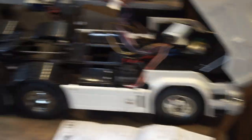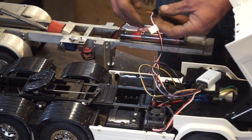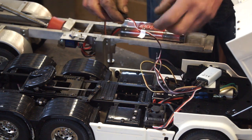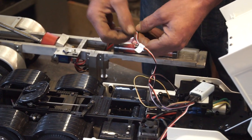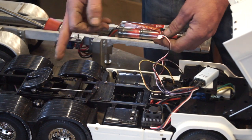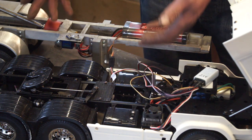The only difference is when you're using two speed controllers — whether on a rigid or articulated vehicle — you get a conflict between the speed controller for your mechanism and the one on your wagon. What you need to do is cut that red wire from one of your speed controllers — I always do it from the trailer side. I use an extension cable between the two with that wire cut, with a few millimetres removed so it can't touch. Whether you use a separate battery or take power from your wagon, the speed controller does the same job.